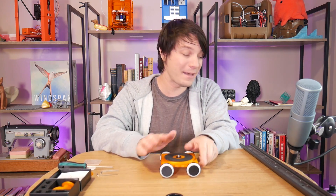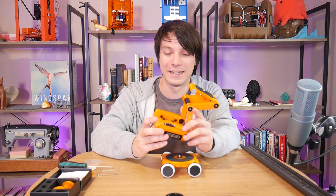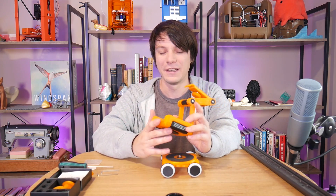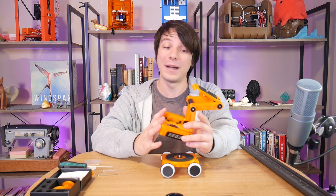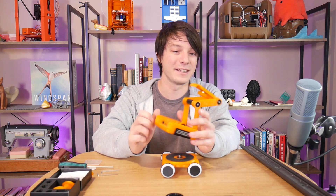So I thought I'd put it together and tell you about my experiences. I first tried to print this in ABS plastic, which is the same material I used for the FlexTilt Head. ABS is quite durable and tough — it prints at a higher temperature than PLA — but it does have one drawback: it shrinks a lot more than PLA.